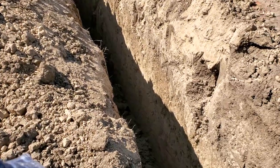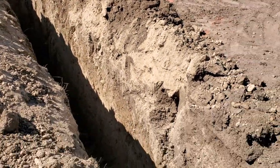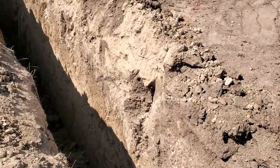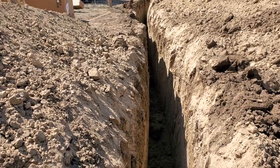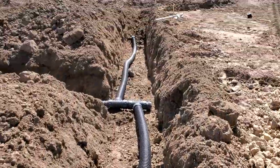So that's going to be for the hydrant, and then the electrical will go in after I fill that up to a depth of two feet. If you come over to my house in the next week, don't fall in the trench — that's like 10 to 12 feet deep.